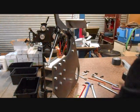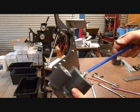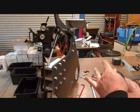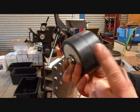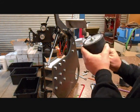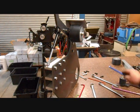The other thing we need to do is put the tracking wheel on. The tracking wheel is stored on the platen simply because it screws into the hole for the 5-inch wheel — it was a nice secure way of transporting it. Take that off. It has a washer with it, bearings installed, cross tube installed, wave washer installed. There is a line of flash down the middle of the wheel that will not affect anything — it will wear off quite quickly when you start using it. Being so thin it is incredibly hard to trim off, so it's just easier to let it wear off in the first couple of minutes of use. With the washer on, simply screw it in, and use a 10mm Allen key to firm it up. That's your tracking wheel.